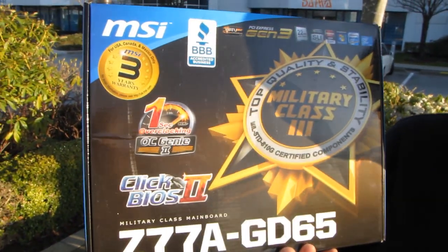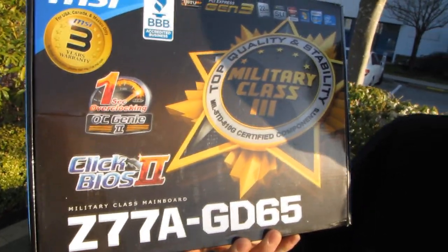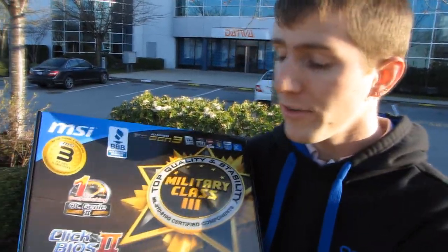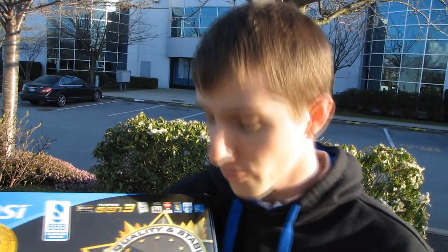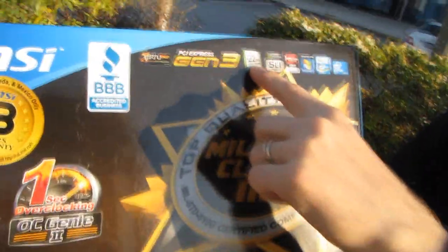Welcome to my unboxing and first look at the Z77A-GD65. This is MSI's first board that I've had a look at on the brand new Z77 platform from Intel. So this is using a new chipset supporting Intel 3rd generation Core i5 and Core i7 processors on LGA 1155. So yes, 22 nanometer CPU ready.